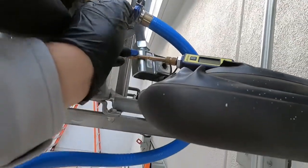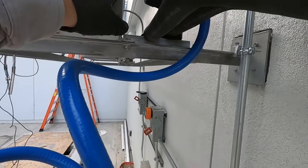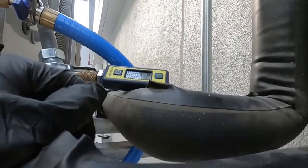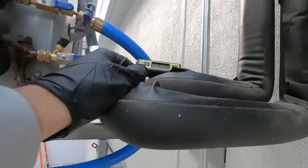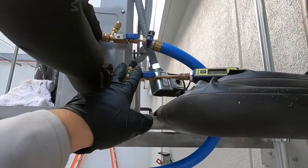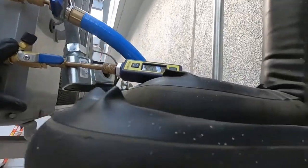I didn't even have the valves open — there we go. It's a good thing to have your valves open. As you can hear, there's a difference in the vacuum sound. These are the AccuTool valve core tools right here. I like using these — they're a little shorter than the Appion's. We're already starting to pull down.